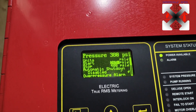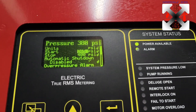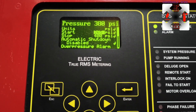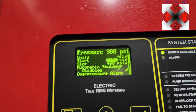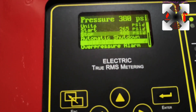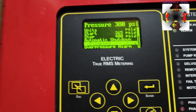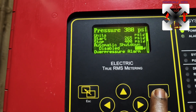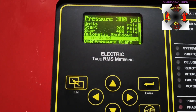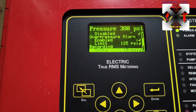With Level 1 you can also change the pressure stats - for example, values around 265-266 are accessible here. Level 1 password access is serious because someone could alter the cut-in pressure above that of the jockey pump, causing the main pump to run before the jockey pump. The cutout stop pressure is 400 PSI, and automatic shutdown is disabled as set. The overpressure alarm is enabled with a limit of 125 and a delta of 10 PSI.